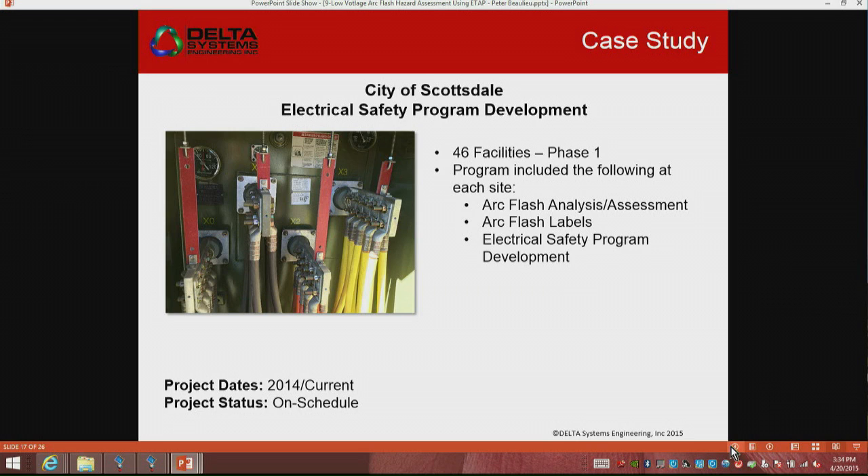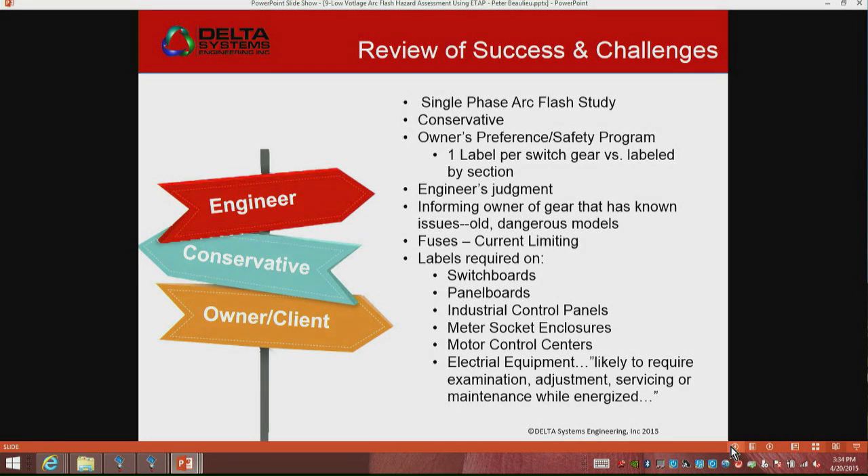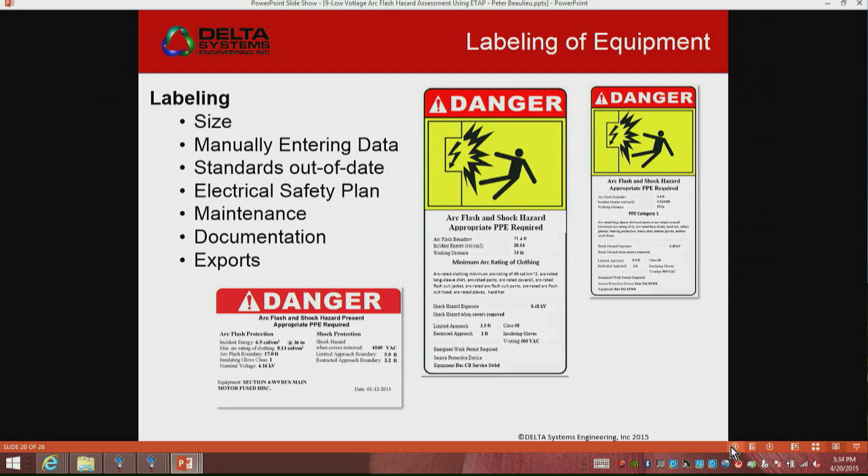We did City of Scottsdale — we're still working on that — and we also did Cuyagas. What we'll find is a lot of these municipalities will come in and say, 'We just need this pump station done.' It's very time consuming, and a lot of the modeling — going through all the different scenarios with all the different pumps, how this thing should operate, what happens when it's on generators, what happens when certain things fail, how do you worry about the time on current limiting fuses and how you get that involved — so having to remodel things that have current limiting fuses in there is becoming a big issue for us.